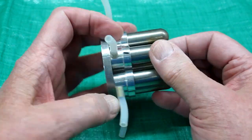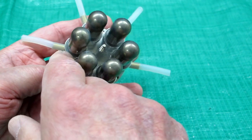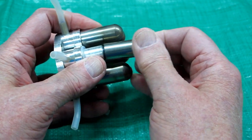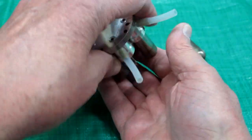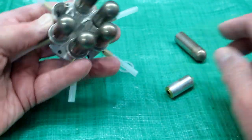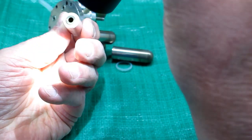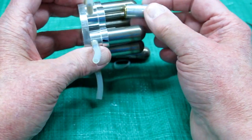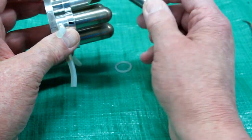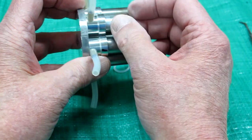To my knowledge, nobody's shown one of these apart before. You wiggle that and I can see there's a silicone o-ring in there. I'm going to make a wild guess that that's the same size o-ring as what's on the cylinder head. And that is a displacer. Get that o-ring out of there - this will not be easy to get back in there. Inside of the tube looks perfectly clean, and this is the displacer - it slides back and forth. We can hear it hit on this end, but more than likely we're hearing it hit on that end. I don't see anything wrong with that.